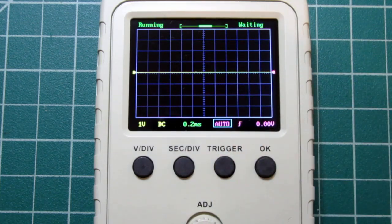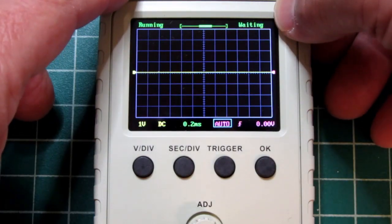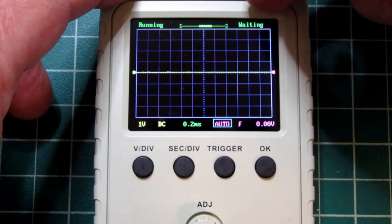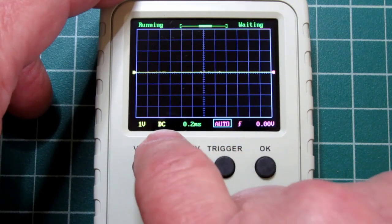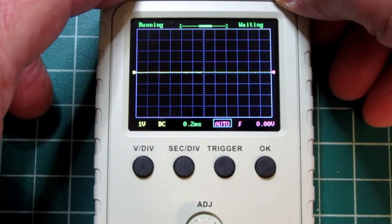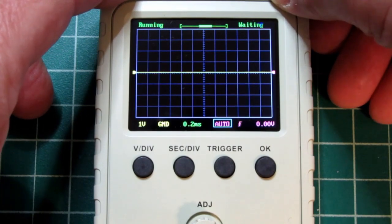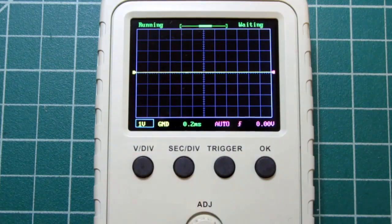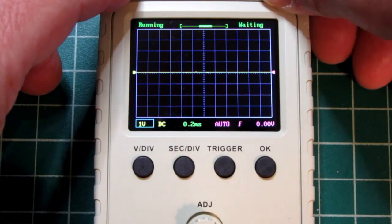By the way, I should have done something which I didn't do. You can't see the switch when you're operating the scope normally — meaning the DC/AC coupling switch up here — so it always shows the position of the switch right here on screen. I'm in DC mode now, I can go to ground, and I can go to AC, and it always shows me that. To center the vertical, you really should have it in ground position first. So I'll do that, hold down volts per division, and it realigned it. And now I can take the switch and move it back.